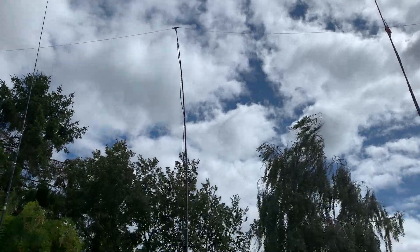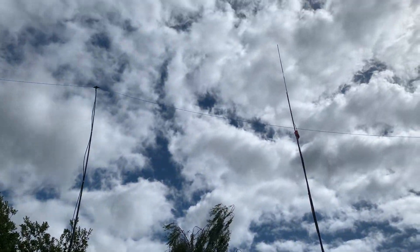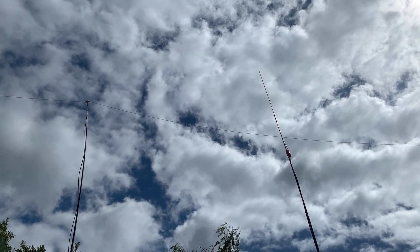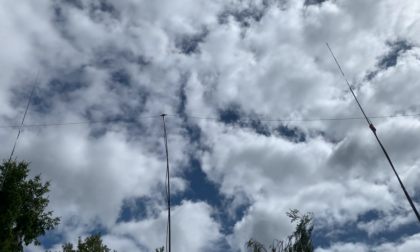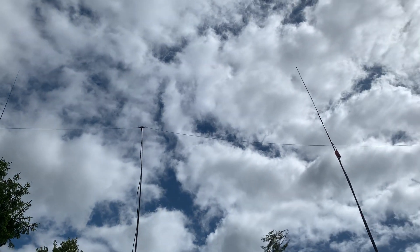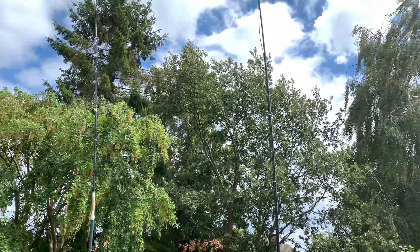So I bit the bullet, looked online, found a design, and built it very simply from a length of discarded RG58 — a metre of RG58 without the shielding, and then just over a metre, actually 1.07 metres. I wound an ugly balun, eight turns on a two-inch plastic waste pipe, soldered an SO239 socket to it, plugged it into my IC7300, and matched it in about two seconds. With five watts TX power, my contact in the Abingdon area in South Oxfordshire is copying me 60 over nine — basically full scale. So it is working very well.